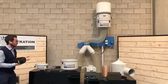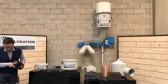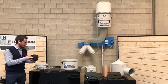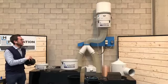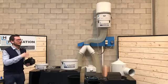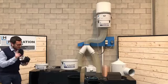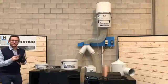Yes. Okay, obviously it depends on the model. You have different sizes of the motors, of course. For the small ones, if I remember well, it's 0.37. And for the bigger ones, we have three sizes: 0.55, 1.5, and 2.2. But in terms of maintenance, what I forgot to tell you is that you also have to take care of the motor, of the engine.